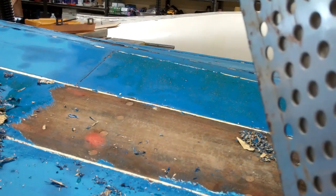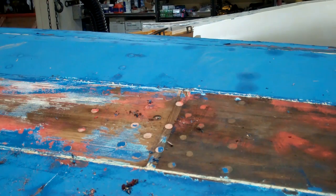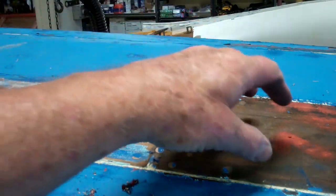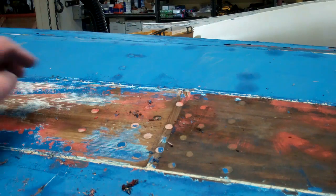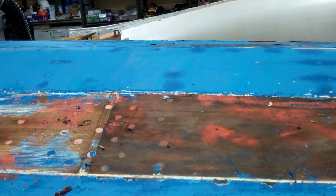The other aspect is we will end up buying a lot of new mahogany and milling it so it is usable when we begin laying down the final planking on what will be a true 52. Here, gazing at the aft plank I've been stripping, the oil just bubbled up and oozed out and it went immediately to bare wood. But the next plank forward and the next plank forward — this paint has adhered. This board we can save. Thank goodness. But people should be careful taking shortcuts, because the shortcuts can come up and bite them later.